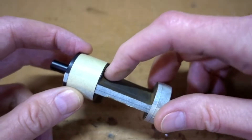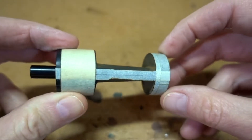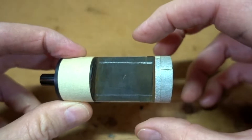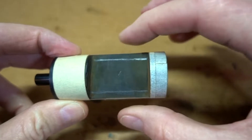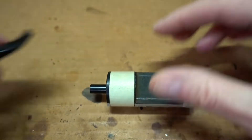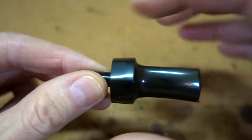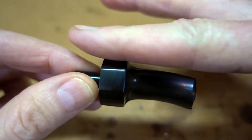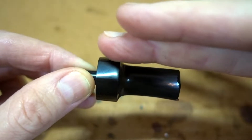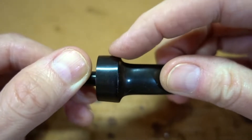Done the mass removal here, top and bottom — things are starting to look like a stem. The next step is to do the equivalent on the sides. You've got to be careful: you don't want to taper this over its entire length. The base of the stem actually goes the opposite direction, so be careful you don't fall into the trap of tapering it and then finding out you've cut off the ends of the edges that you need.